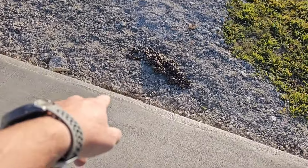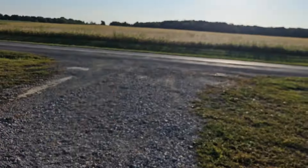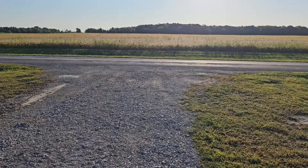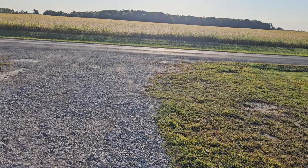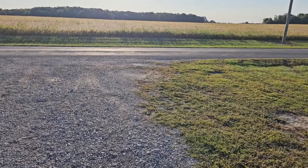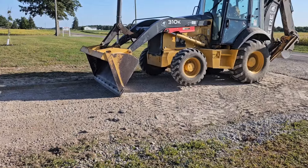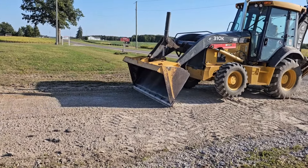That also means we've got to take about an inch or two of stone out here, and six inches of stone out by the road, and deal with the tube going through the ditch there. There's almost no water that goes through - I don't think I've ever seen any ponded water up here. It doesn't have to be real big, but you can see it's peaked up through the driveway - it's floated a little bit. We're going to have to fix that and get it deep enough to get good concrete cover on it, or it'll just crack apart.